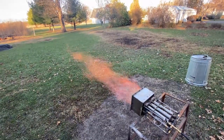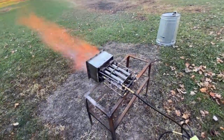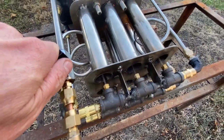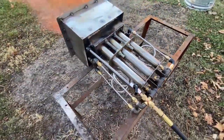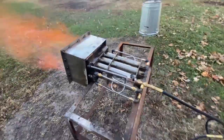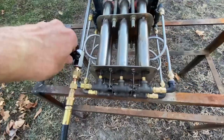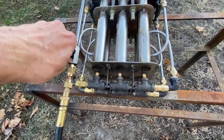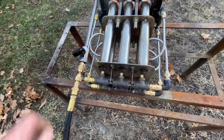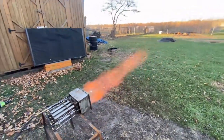This tells me that in a future design, it wouldn't hurt to double the size of this thing to ensure that doesn't happen. The reason I don't like the liquid propane spraying out is that it's pulling less air when it does that. If we were to vaporize all of that propane, we would have a much higher pressure in that box, I believe. Also, that liquid propane can start to freeze up the air tubes with condensation.